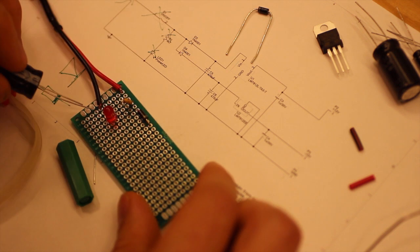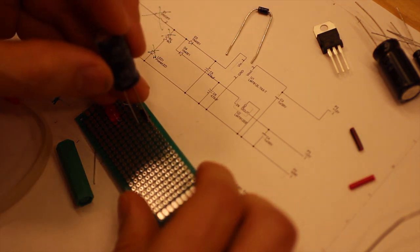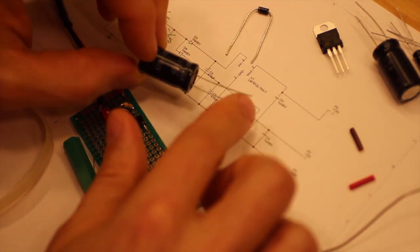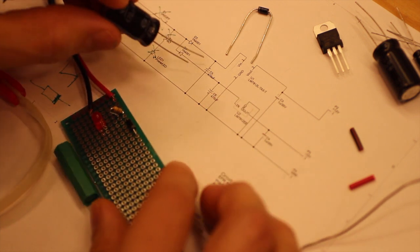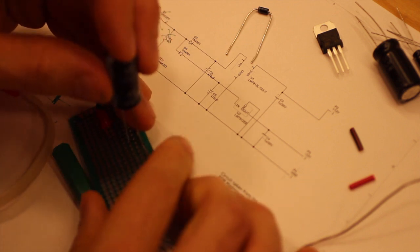And this one is the black line that we have, the LED right here somewhere. So, and we should have this from plus, and on these you have minus, minus, minus. That's the short leg, and the long leg is positive. So this should go from positive on the plus side to ground.